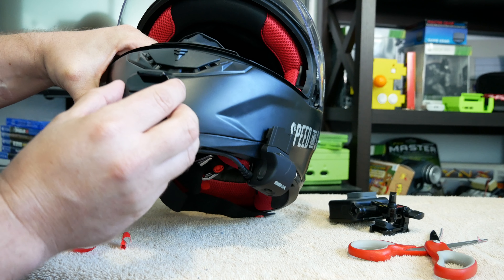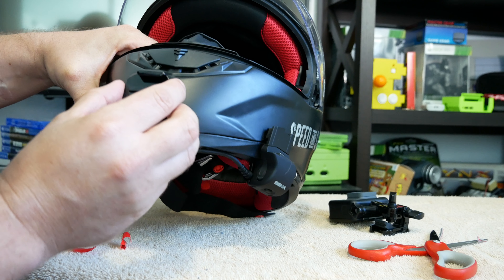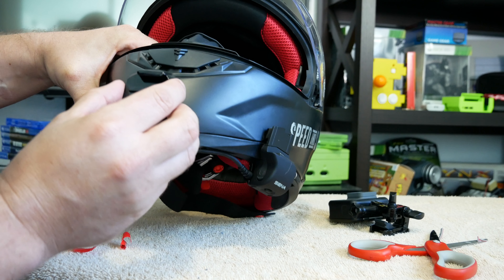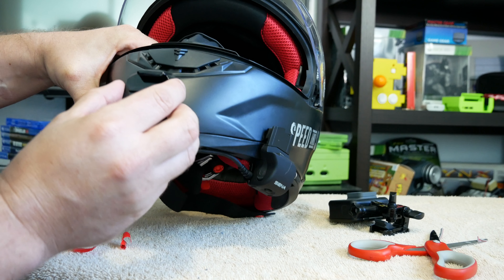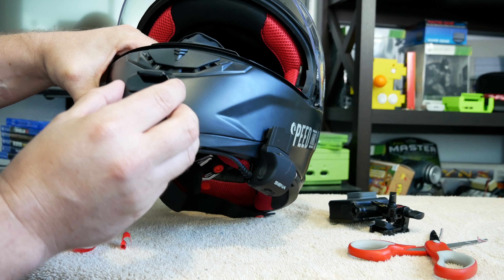So we have our mold made. I would set this aside for maybe an hour or so, just to let it cure up and make sure it's going to be good to go for the next step. What I like to do is cut the 3M tape into some strips and put them in here. If you put a big chunk on there, it has a tendency to bind up in the little curved part. If you cut it into strips, it seems like it sticks a little bit better. Once you put the 3M tape on, you're going to end up with a bunch of stuff hanging off — just take the scissors and trim around it.